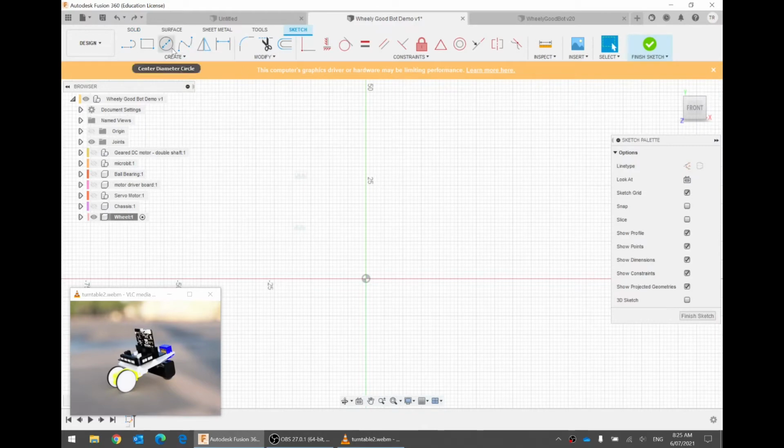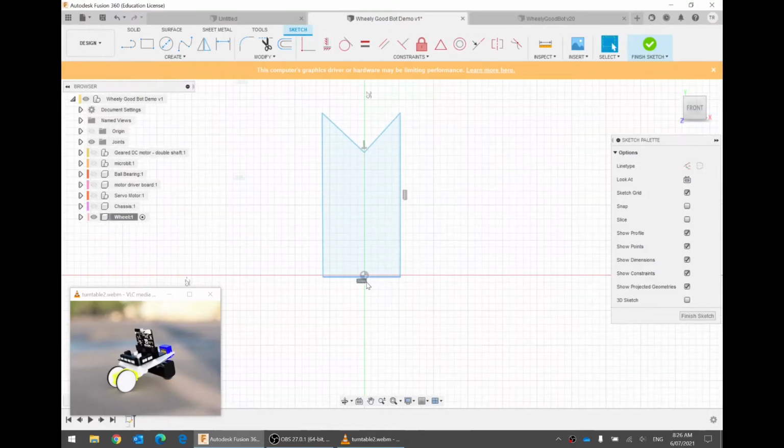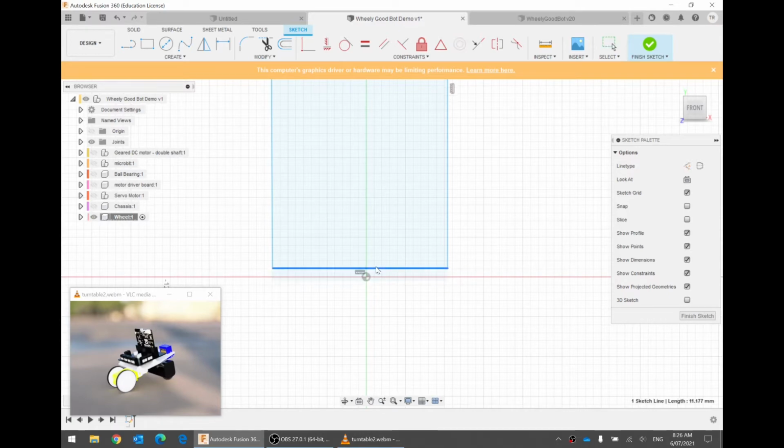I'm just going to undo, we are going to go with the line tool, click up here or press L, and from above, we're going to go down. There we go. Beautiful. So now this is the groove, and then we will revolve it. We'll spin it around this line here. Now there are a few things to set up. Number one, this line is not straight, so you can click on it and click the horizontal vertical. Escape. Number two, this doesn't quite go through the center, so I'll move this up a little bit so I can see what I'm doing.